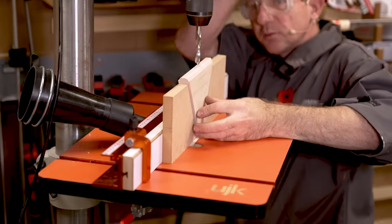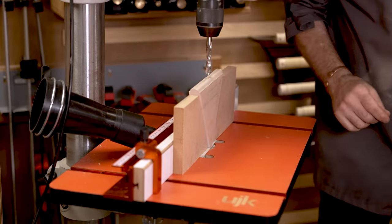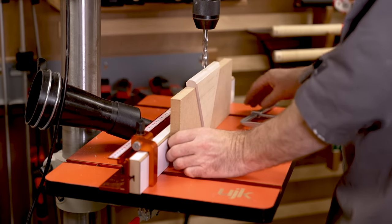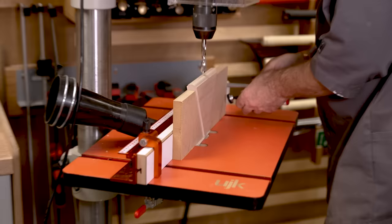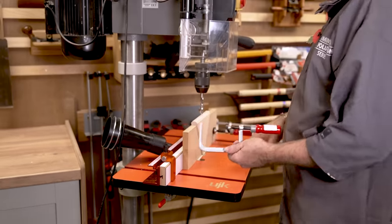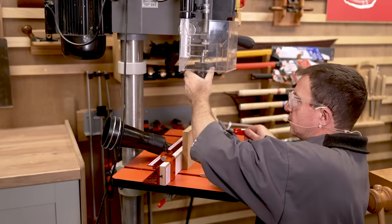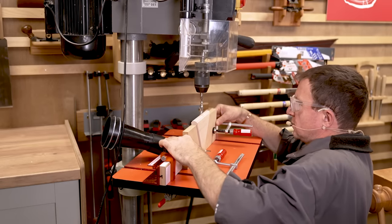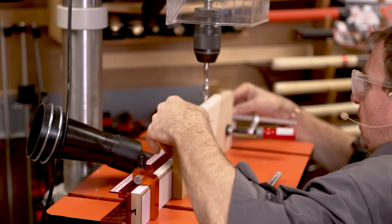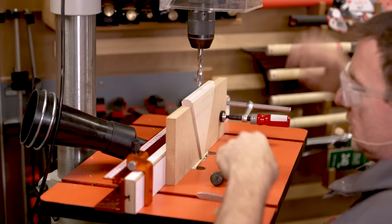just lining up the tip of the drill, and it's good to use a lip and spur drill for this. So this is 10mm. Having done that, I'm going to come back, and again, drilling table, oh wow, what a difference. Something that you can load, sit on. We all get our pillar drills that have a cast iron table and nothing to help you do the work. This makes a difference. So now, lining at the front. Too much. Come back a little bit. Using my hand in behind just helps see it, that's good.